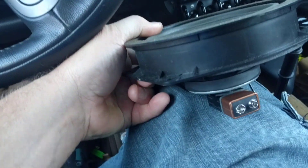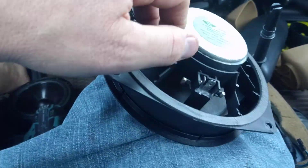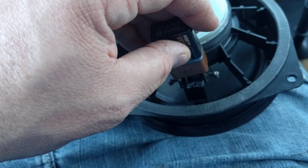This is for the conclusions, but I'm also going to show you a little trick here. If you don't know what the polarity of your wiring is — like I didn't — take a 9-volt battery and take the original speaker and touch it.